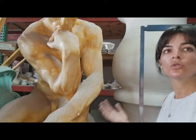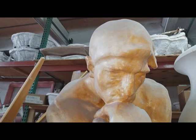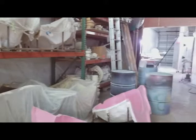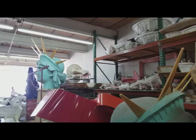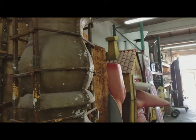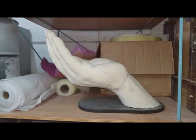It's all made by hand. We use tools and machinery, but there is no factory production at all. Everything is done by hand. So it's a lot of quality, but it's a lot of time and budget. We store all the molds because artists usually don't have the space — half of this building is for all the molds we store. Before we destroy anything, we always ask the approval of the artists. We tear down the skins, break the plaster shells to make sure nobody can use them to make new ones that would not be approved. That enlargement over there is the hand of a French artist named Hervé di Rosa — we molded his hand and he loved the shape, then we enlarged it because he liked the idea.